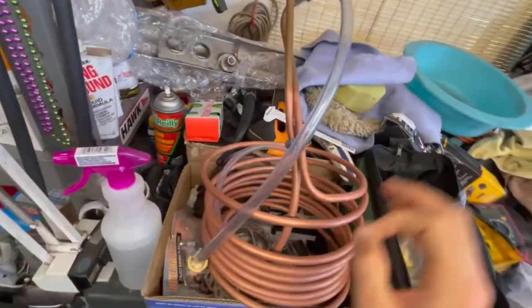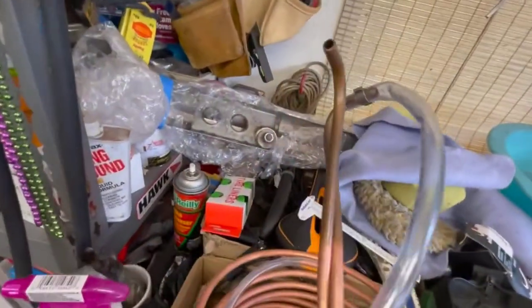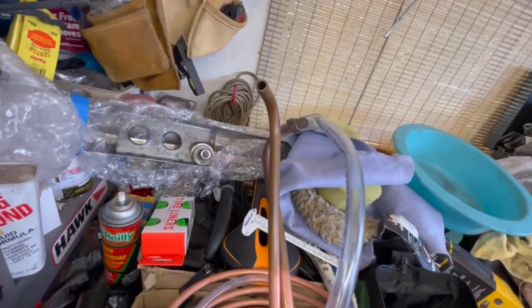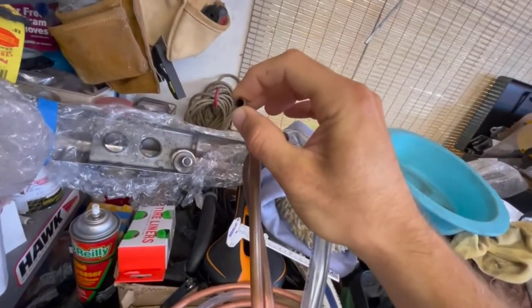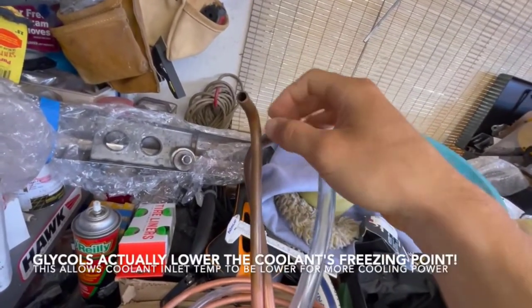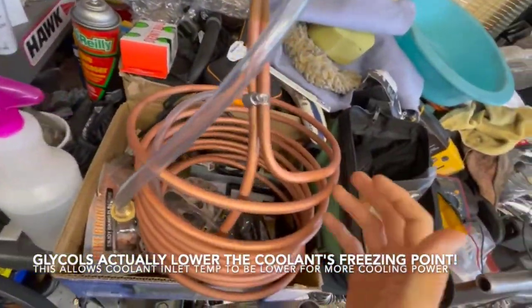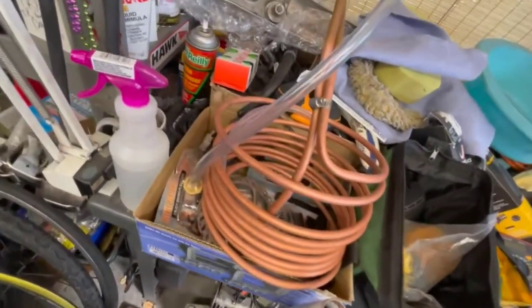Another thing I'm going to make note of, before we jump too deep into math, is the tuning parameters at our disposal, which is just thinking about the properties of the fluids involved here. We use tap water, but sometimes you'll see, especially with the higher production volume beer makers, they're going to use other coolants like glycols, because they've got better heat transfer coefficients. So they're going to absorb even more thermal energy as they flow through our system. They might also be less corrosive to all these copper pipes, especially if you're doing this with hundreds of gallons of beer all year round.